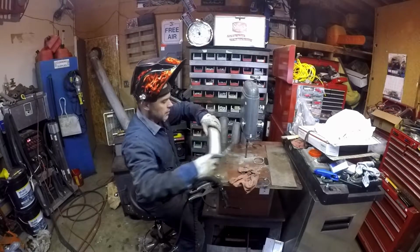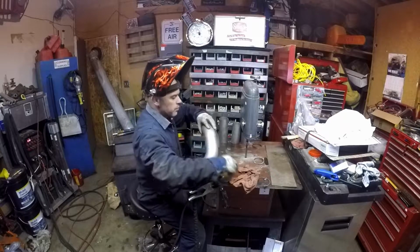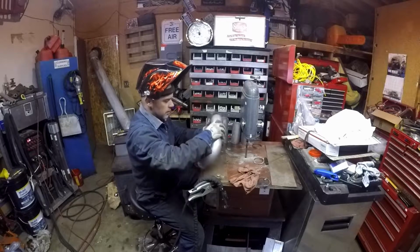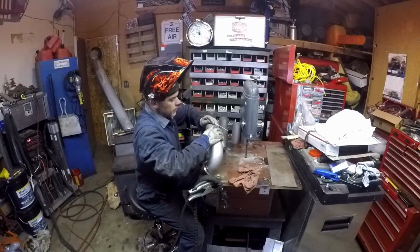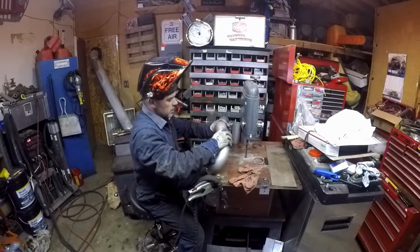That sucks. That might end up getting fixed, because that's going to suck to weld. But I just push the tube together and get a super tight spot, and then you melt it right there, and it'll just form together without any rod usually, and you're good to go. And then on the back side, you've got to try and push it together as best you can.